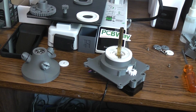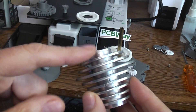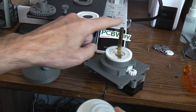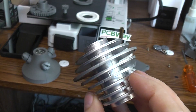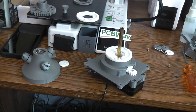I'm also in communications with them about CNC because they do CNC parts too. The very top part of the whole Robbie the Robot project — a piece that's currently just spray painted and printed in separate stacked pieces — would normally be turned in aluminum. It has a larger hole for the lamp socket and a smaller hole to mount onto the rod, with a 4-40 set screw to lock it in place. I'm communicating with them to find out if they're interested in letting me test their CNC services on this part.